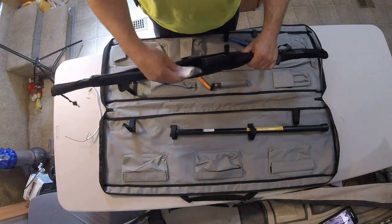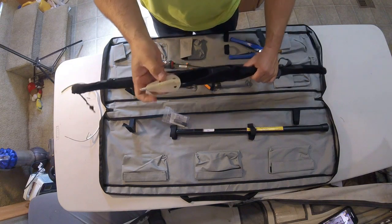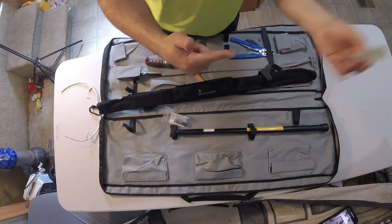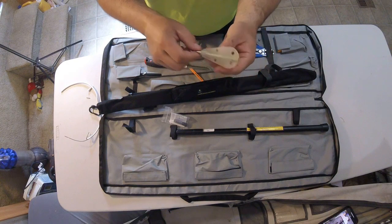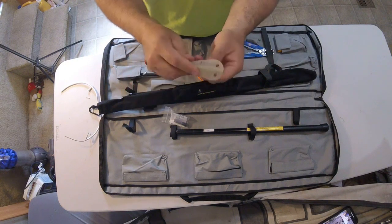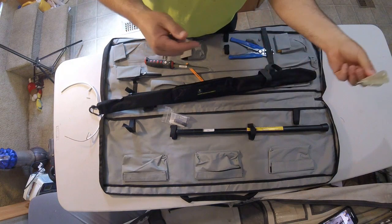The other part is this. Dude, they have all of these adapters that go on the ends of your glow rods. Like this guy right here. This is kind of a big adapter that goes on the end of your glow rods. This way, as your glow rods are fishing around, they bounce off of obstacles instead of just hitting obstacles and stopping. So this would be if you're going through an attic, sometimes going through walls, but you'd never be able to get this through a hole because it's too big. But if you're going through an open space that had a lot of obstacles in the middle, this would help the glow rod bounce along.